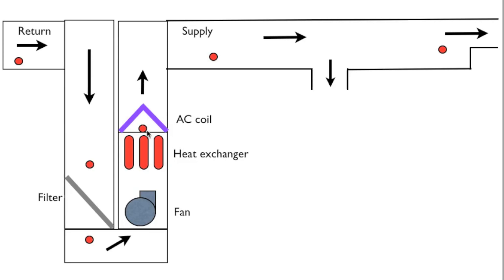If it's less than one inch water column, it will actually move more air — and there are numbers for all these things. As we go through the heat exchanger, I've got an air conditioning coil up here. There's going to be a pressure drop across that coil. If I check here, I would get a certain positive pressure, and up here I would get another positive pressure. Taking the difference between these two would give me the pressure drop of the coil — how much pressure I'm losing across it.